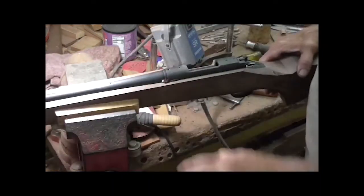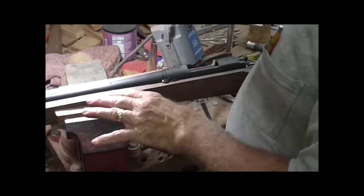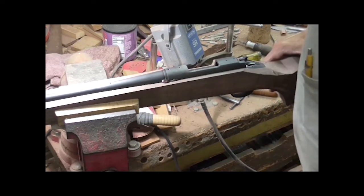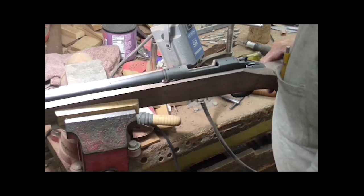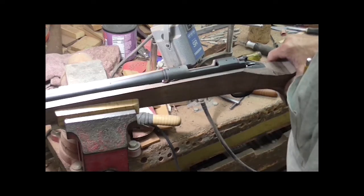I'm really happy with how this turned out. The barrel is still sitting nicely in its channel. With this Mannlicher thing, you have to make sure that it doesn't touch hard anywhere in that barrel channel. I'm going to give that about 20-30 minutes to dry, then come back and check on it. I'll make me a knife literally out of wood — a little sliver, cut it on a bevel. It's got a little jagged edge, kind of serrated like a steak knife, about as sharp as a razor.